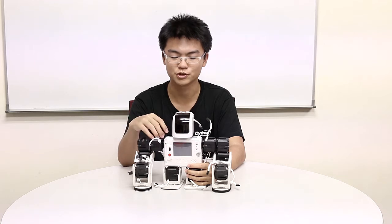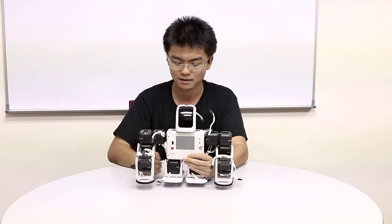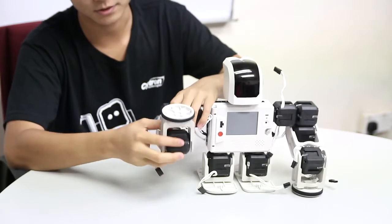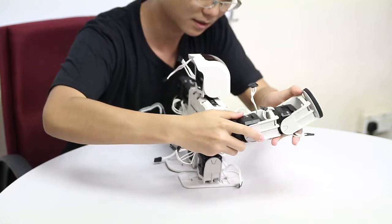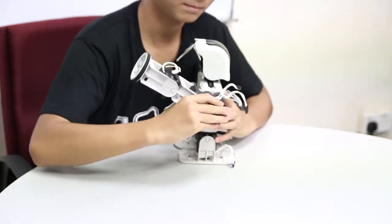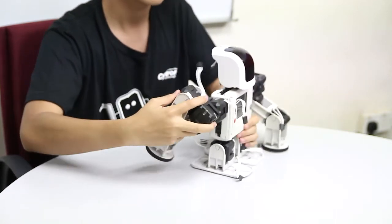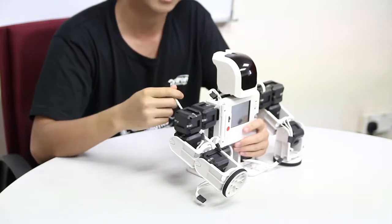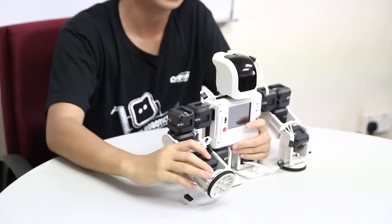Since you're already done building the robot, you should start to connect the wires and then set the limits for the servos. For the legs it's pretty obvious — all the way here to here — and then for the wrists and elbows it's also very obvious. But for the shoulders, it's best to have a degree of freedom of about 90 degrees for the shoulders or a bit more, all the way up. Make sure that your arm can turn at that angle. In order to achieve it, take note of the wires, because it's a very big angle and there's a possibility that the wires will get tangled. To solve this, remember that you can use the extension for the wires, or you can change the orientation of the motor to avoid any problem with the wires.